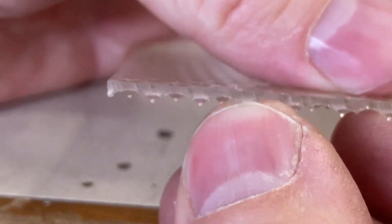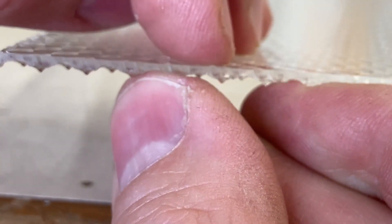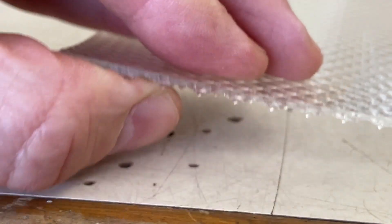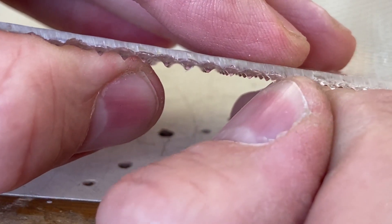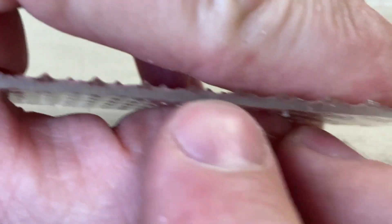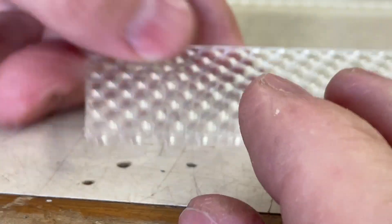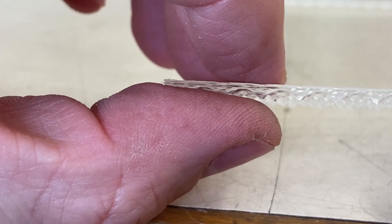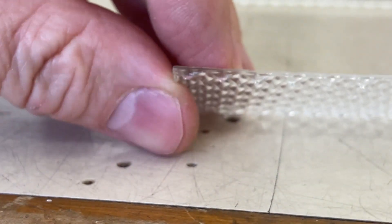If it were cut the other way around, possible scalloping at the edge might occur towards the smooth side, and I wanted to avoid that. That's why it was cut with the textured surface facing the table, so that any possible surface scalloping — which runs through the thickness of the material along the edge — would be hidden between the surface dimples. And really there aren't any. Maybe on the offcut side I turned it upside down, but I can't see any. But should any occur, the scalloping would affect the side where the saw blade rotation exits, and it would be hidden between the surface dimples. This one is cut well.